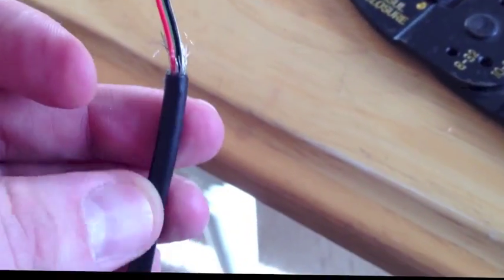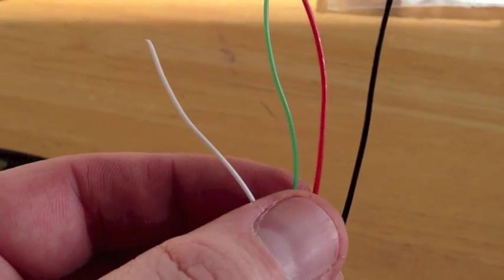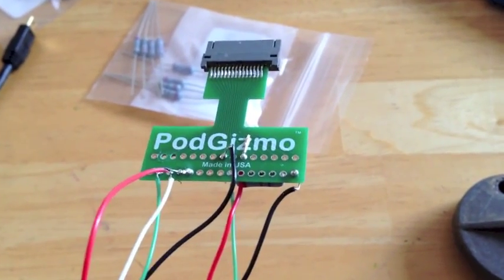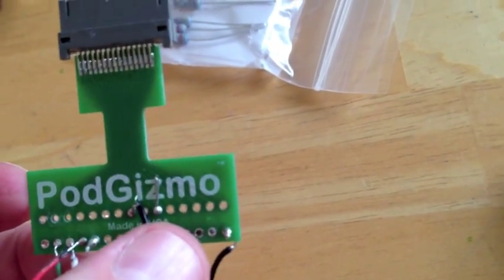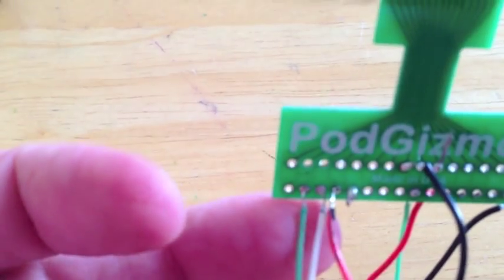When you take apart your USB and cut off the end, this time you're going to want to save all cables — you're going to need the white, green, red, and black. Okay, I'm going to have to clean this up a little bit, but here's what I did. We got the three right here from the USB, and then this black one ended up going to number 16. Then going right down the order: green is 27, white is 25, and red is 23.